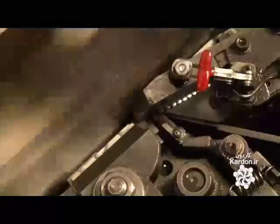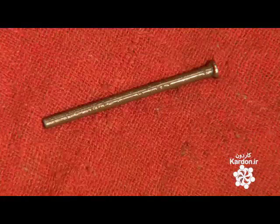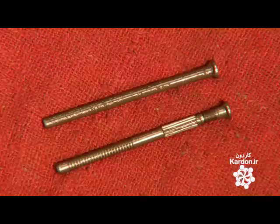The stem blanks move between serrated rolling dies. The dies form grooves to allow the stem to be gripped by a rivet tool. They also make ridges that will serve as a breaking point during rivet installation. This is a slow motion close-up of the serrated rolling dies in action. Here's the rivet stem before and after forming.